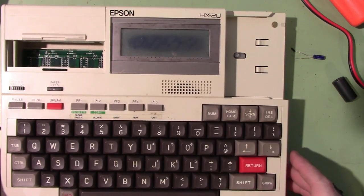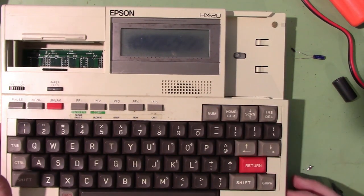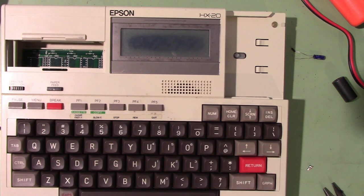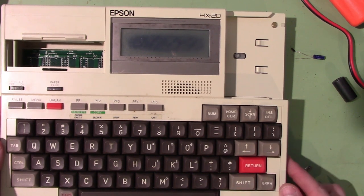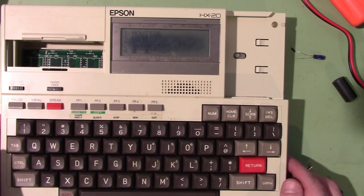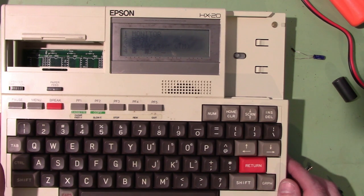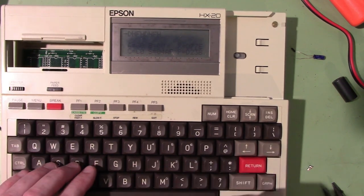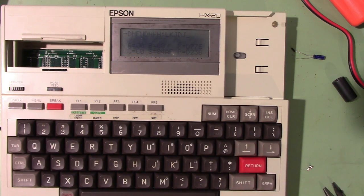It's sitting back together with the battery plugged in. It won't go down all the way, but let's see if the power will cut on with the 4.8 to 5.1 volts from the battery pack — remember, we needed like 6 volts from the power supply to make it cut on. I'll cut it on now. Yeah, it cuts on fine! So I think we were just having issues with the power connection on that oxidized wire. It seems to be working — that's awesome!